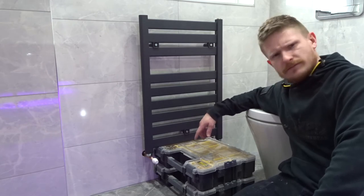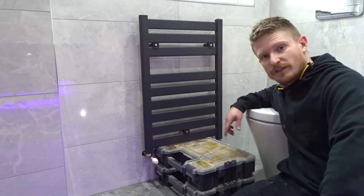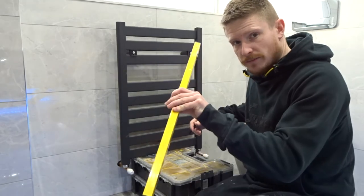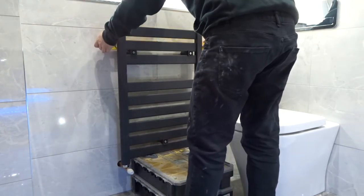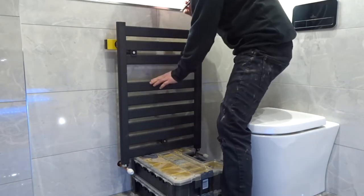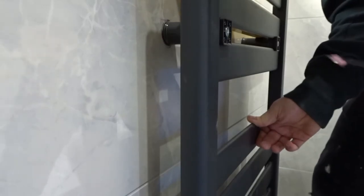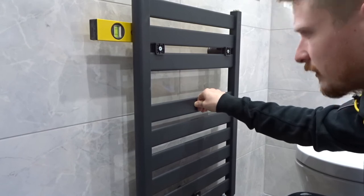Once you've got the toolboxes at the perfect height, grab the little sliding wall brackets and pop those on the back of the radiator. Grab yourself a spirit level and sit that either on top of the radiator or on the two brackets. Push the radiator back so it's sitting on the brackets, hold the radiator level or have someone do that for you, then just draw around those brackets. It can be a bit tricky to get the pencil in there. Repeat that step on all of your brackets. Now we've got them marked, we can lift the radiator back away from the wall so we can drill our holes.